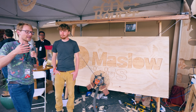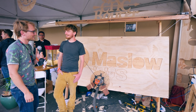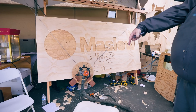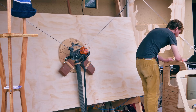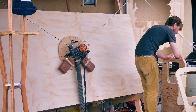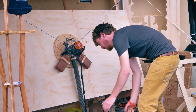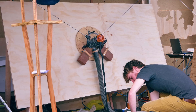And if you see my videos on the hang printer, you'll kind of know what that ends up looking like. It's a lot like the hang printer - very similar. So it's a router on there, it's just sliding over your work piece, and it has two bricks just to keep it pressed on, and that never jumps around, right? No, it's very stable. It doesn't have any sort of jerk factor. When you're routing by hand, if you hit a knot, it can jump a little bit and bite. We don't really get that because it doesn't react - it's just stable inertia.